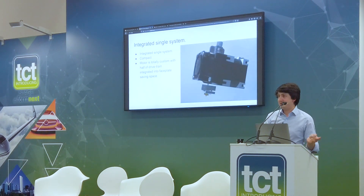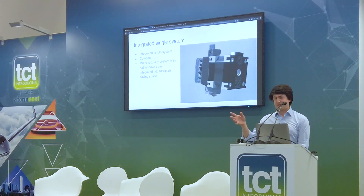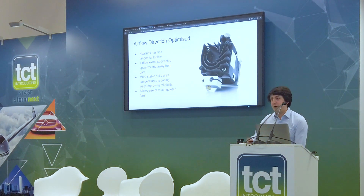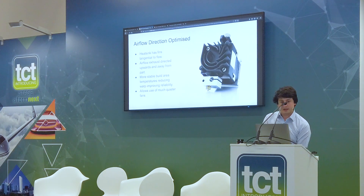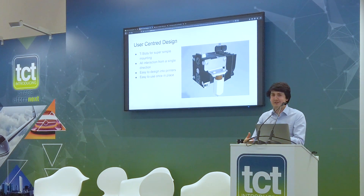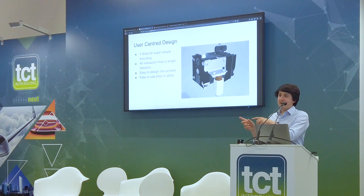Single integrated system, super small, super light — it's about 380 grams, somewhere between 300 and 400 grams. The motor is very custom. The airflow optimization is really cool: the fins go up and to the side, which means the air goes up and to the side — it doesn't go down onto the print cooling it down and warping things. So you have this really efficient fan flowing up and away. The T-slots on the side mean you can mount it to the printer really easily, and you can also mount stuff to the side of the extruder itself — things like bed leveling sensors and fans — like backpacks on the side of the extruder.